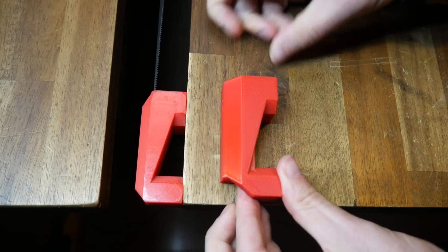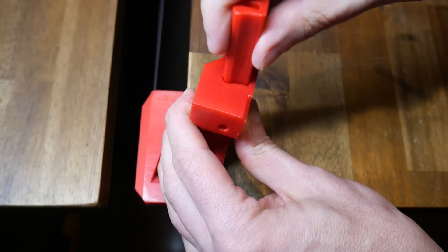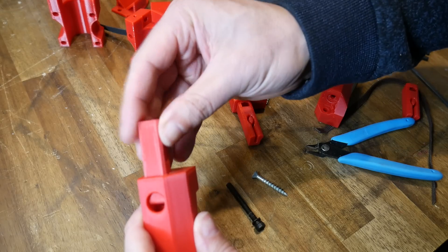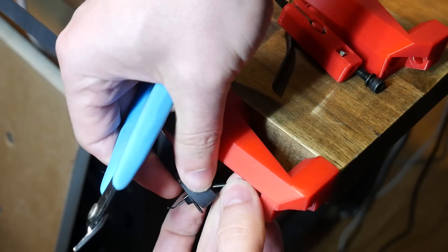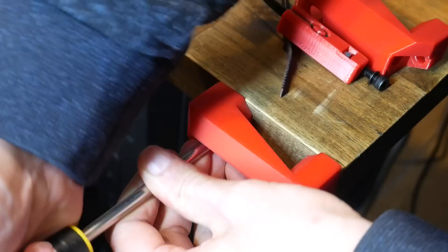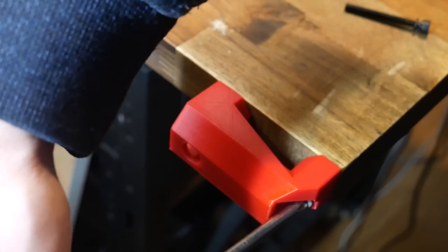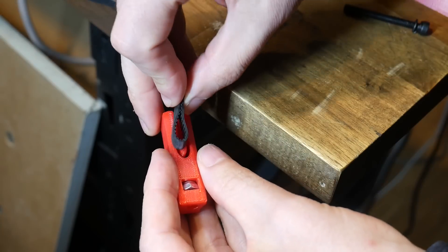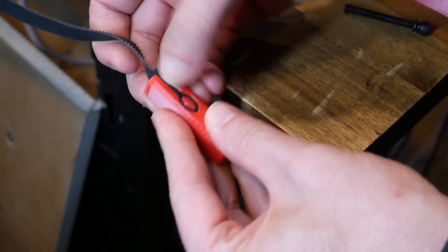There were a few designs like this available on Thingiverse, but what I liked about this one is that the exterior dimensions match the originals. I did find the clearances a little tight between the two pieces, most likely due to a barely drooping bridge section on the inside. I rectified this with a small file on the housing, and smoothed the outside of the tensioning piece until they could interface a little easier. To prep the internal piece, we need to insert an M5 locknut — it goes to the bottom before sliding sideways into position. The belt is then inserted by folding around on itself and squeezing down into the cavity until the top is flush, ideally a very snug fit.